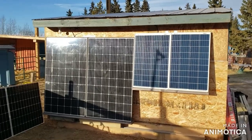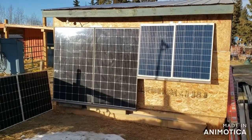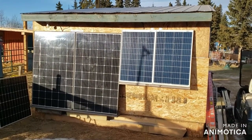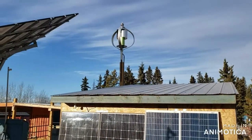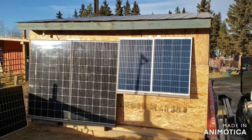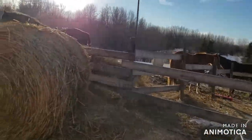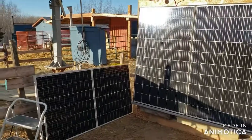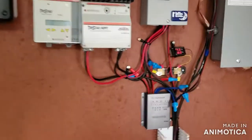We're at the back of the shed now. You'll notice the two larger panels to the left — those are the high-voltage panels — and you'll notice they have shading at the bottom. The two panels to the right are the 100-watt panels working in conjunction with the windmill controller — that's the hybrid system. It has just a little bit of shading. That pole there is causing some shading, and it looks like one panel is also causing a bit of shade on another.